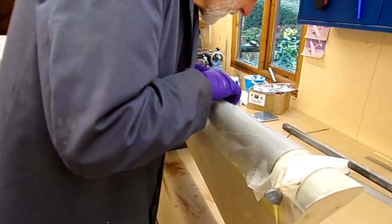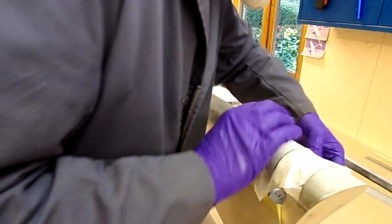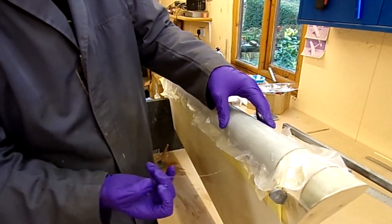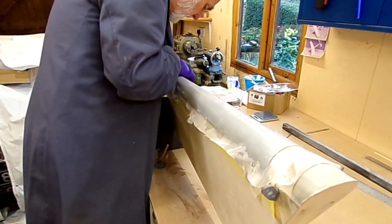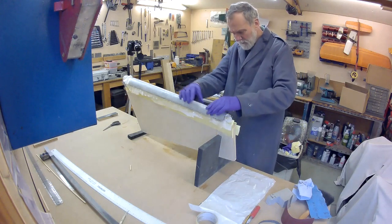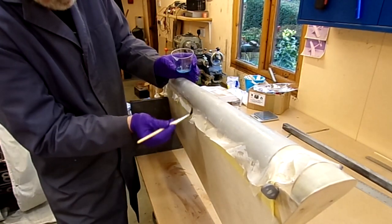Pushing that, make sure the fiberglass is correctly centered. But the strand of fiberglass there going over the top of like that. Making sure all the air is forced out. Going down far enough, it's all completely wetted. Anywhere that I suspect I can put a little bit of extra on.